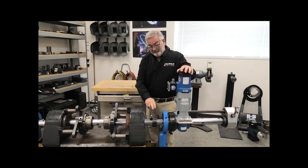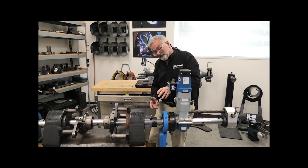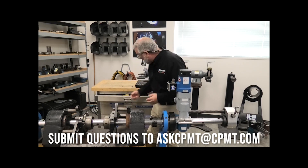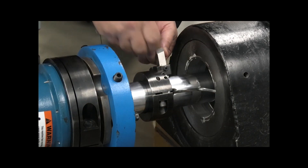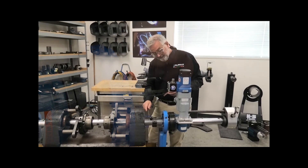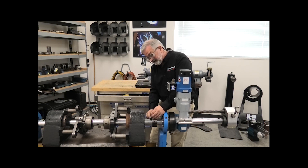One thing I always like to do with a boring head like this is make sure the gap on both sides is pretty close to the same, because if I crowd it one way or the other I'm putting the head in a bind. The way I check this is I loosen both set screws — the set screw in the slide and the set screw in the bar — and if I can move that tool freely, that means I've centered the tool slot exactly with the boring head and the tool slot in the bar. Now I know I can freely move this tool bit at any elevation without it binding when I tighten one or the other down.